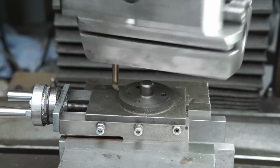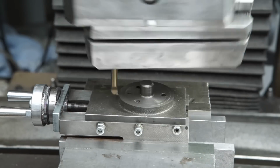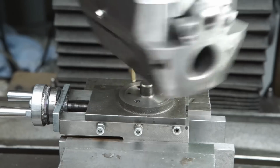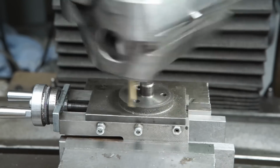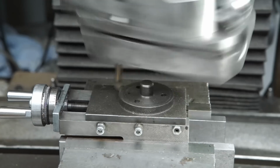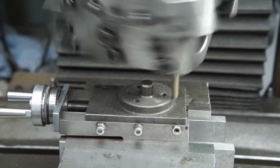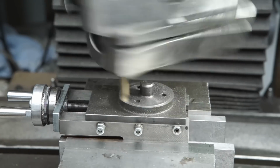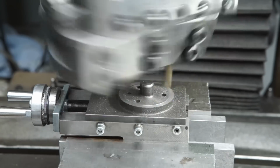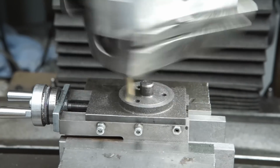The mill had to be run in reverse, as the facing was done from outside to inside and the tip of the bar had to point inwards later. Increasing the speed a bit, running in reverse helps. Depth of cut was about 50 microns. This cleaned up the entire surface.